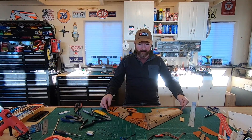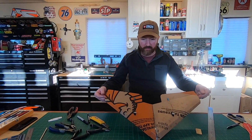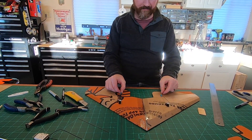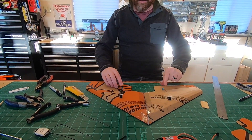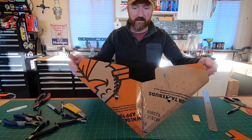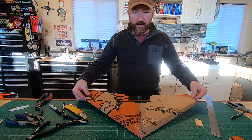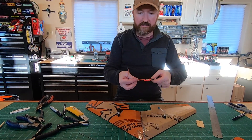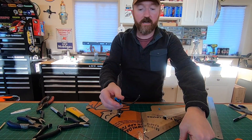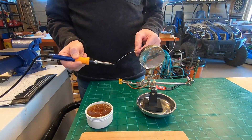We're at a good stage here. As you can see, we got the wing all built, servos are pretty much installed, and our 3D printed control horns are just sitting in there — not glued in yet. We got the Z-bends all hooked up, so basically the linkages are all done. Next step is wiring the speed control, but I've got to solder it all up first.